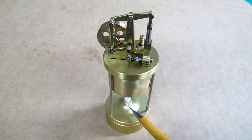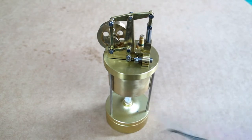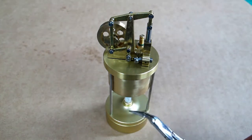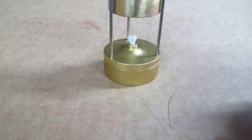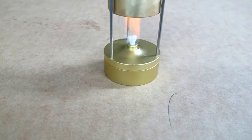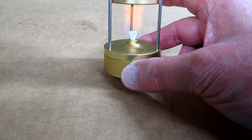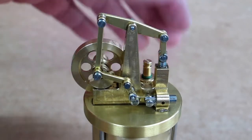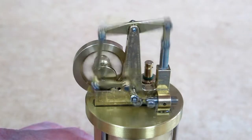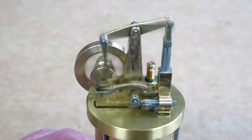We'll start off with a reasonable sized fire. If this gets too hot, I take something like this dental tool and push that wick back down a little bit. If it looks like it's getting to be a bit weak, I'll reach in here with a pair of pliers and pull that up a little bit. That's a pretty large fire — that'll be too big for the engine. But we'll leave it like that until it builds up pressure. As the pressure builds up, you may start to see bubbles on the power piston or on the sliding valve. And that fire is too big, so I'm going to reduce its size a little bit.